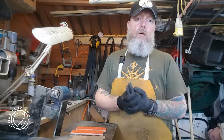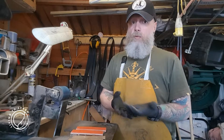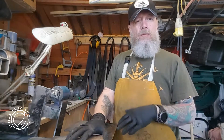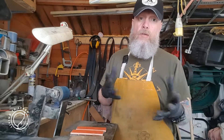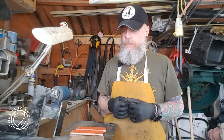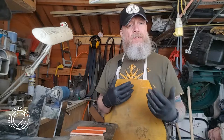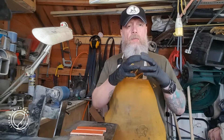I'm no expert, don't get me wrong, but I've been doing this a while. I've been putting handles on things a hell of a lot longer than I've been making knives from scratch. A few people have asked me about handle materials, why I use Micarta or G10 as opposed to natural wood. I do use wood, but the Micarta, being man-made from natural materials, is a lot more stable — from a manufacturing point of view it behaves itself, and from a longevity point of view out in the field, if the knife gets soaking wet or left out in the sun, the Micarta behaves itself.